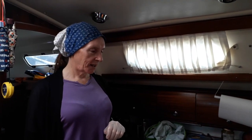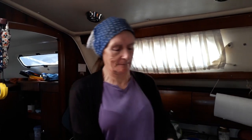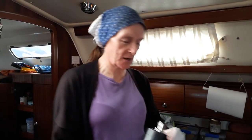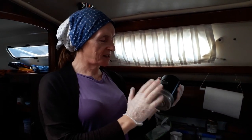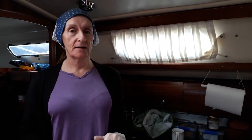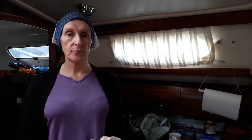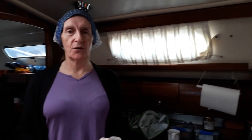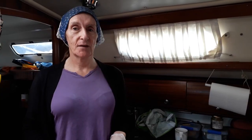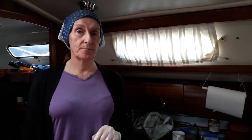So in our trials and tribulations of sorting out our windlass motor — where are we? We have the motor out. We have it partially disassembled. We've managed to get one end off. We've got to get the cap off so we can remove the carbon brushes and then slide the rotor out, then we can clean it and put it all back together again. We got it off with liberal coats of oil — the key's still there, I can't get the key out for love nor money. There's a rubber gasket and once it got sufficiently oily and greasy it just slid over the top.